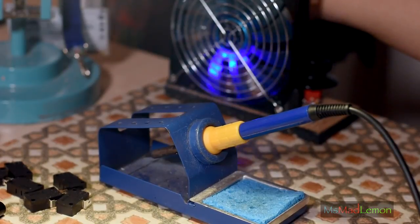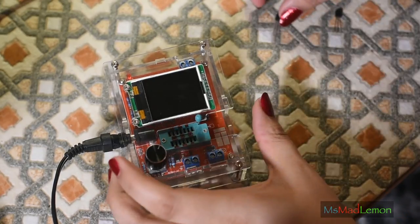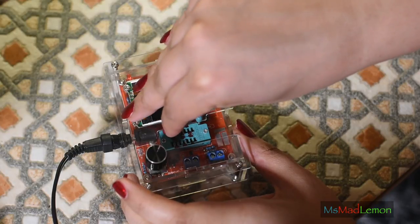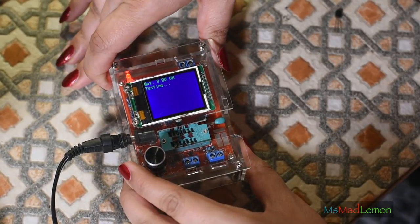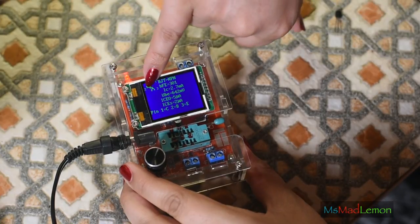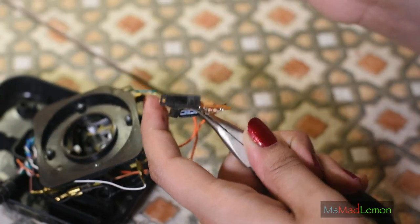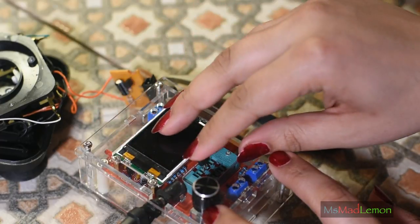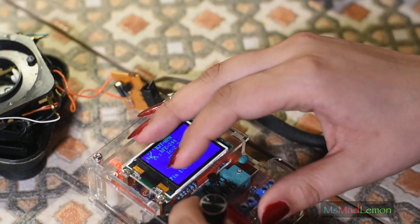Okay, fume extractor on. So while the soldering iron is heating up and before we desolder these from the board, let's just test the new 2N transistor. This is the 2N4401, which is an NPN — and that works, it's recognized. It even tells you the pinout. I hate desoldering... Okay, done. Let's test this — see if this is the culprit or not. This actually seems to be fine. I wonder if the other one's fine too. What would be the culprit? Maybe it might be a short. Let's check the other one, the PNP.